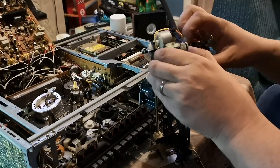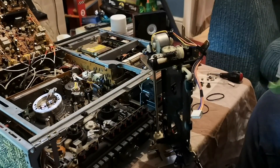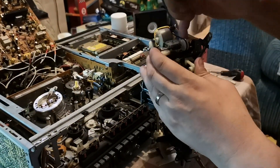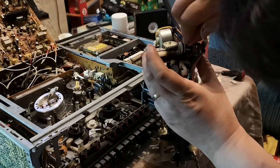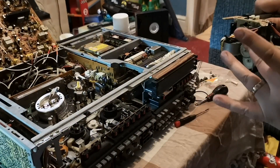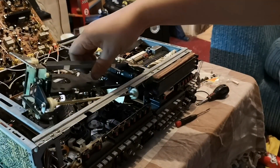What I decided to do was make one good machine out of two machines. I started with this 3v23 and had a go at repairing it. Thinking the problem was with the loading mechanism, I reset the loading cradle as far as possible and fitted a new belt to the actual loading mechanism itself.